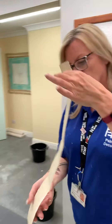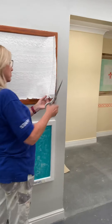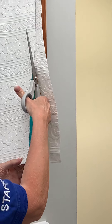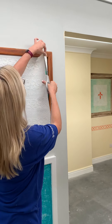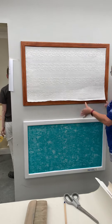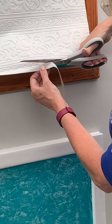Obviously, we know that the off-cut is a slip hazard — it needs to be folded and either put under your table, in a corner, or in a bin. While I've got my shears, I'm going to carry on cutting these three edges off. It hasn't taken me long because I haven't left it to soak — I don't want you rushing this, I want it to be perfect. I want the cutting to be perfect, no bubbles, and I want it to sit on the board perfectly. It needs to be well pasted, well applied, and well cut.